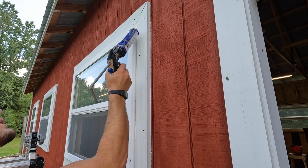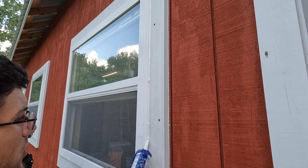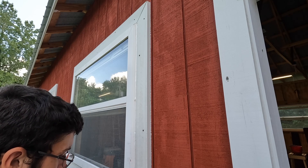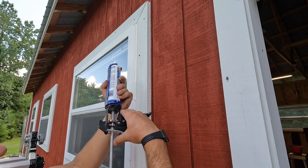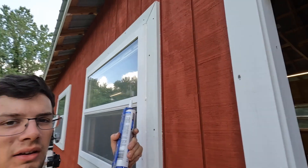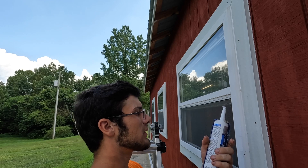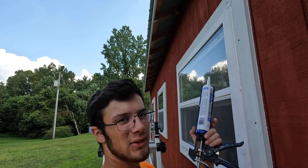This is going to be a lot heavier. The angle of your tip is super important — that you can only learn by feel. Basically just doing it and clicking right at the end. Release that pressure so you don't get the big globs. When I start caulking I had a lot of caulk flying places because I didn't learn that. So that'll save you a lot of time. Click it as soon as you're done.